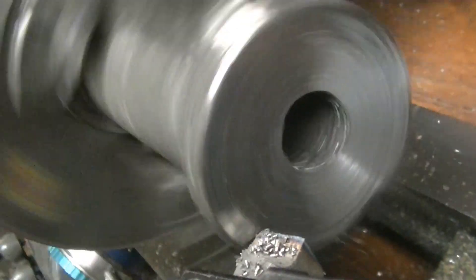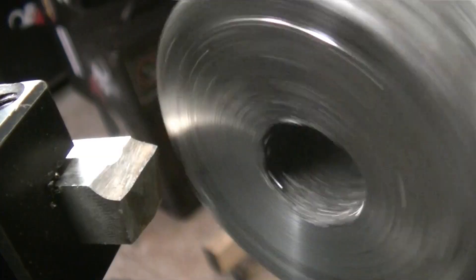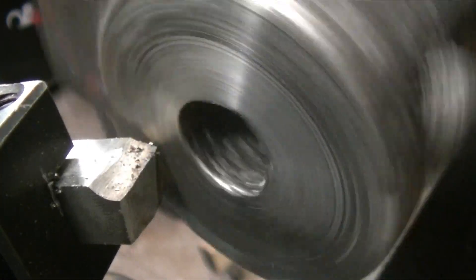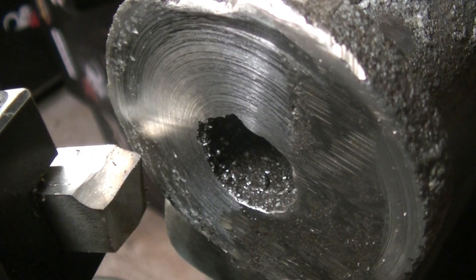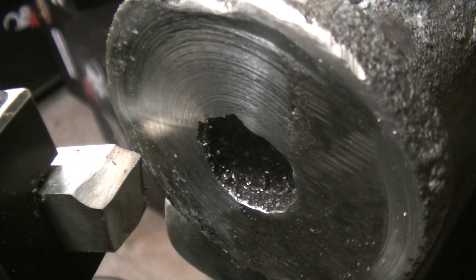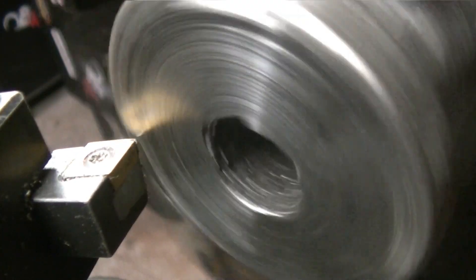It's looking way better - I think it's way better - but there's still the normal issue of cast iron having that skin. It's doing the tool, but I think it's just the outer skin problem of cast iron. As soon as I get to the parts that don't have that outer skin I don't have as much trouble. So I'm going to switch back to carbide to make it a little easier.